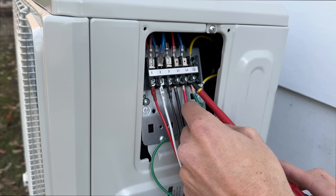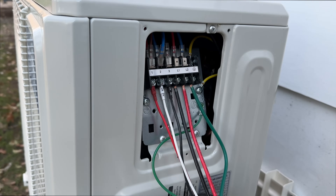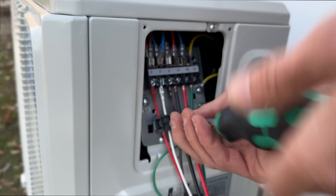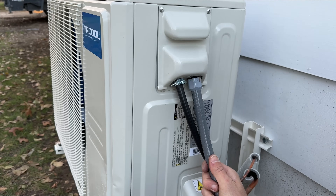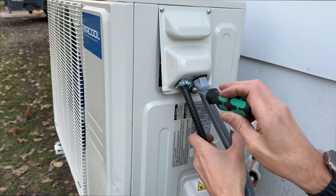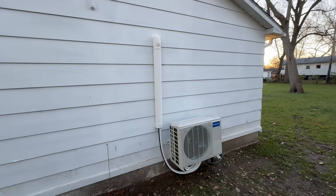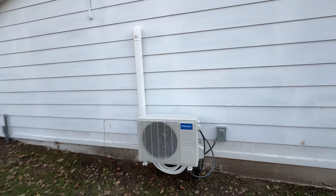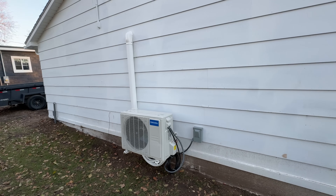I connected the liquid-tight through and now have my two hot conductors and my ground coming in to the screw terminals. I'll try this retention device — I haven't tried it before but it might help get that cover on, as those covers can be a little tough to get on. Sink in the three mounting screws. Here is what the finished product looks like — we could shorten up some of the wire harnesses, but for a DIY kit overall it looks pretty good.